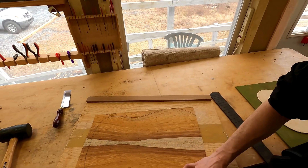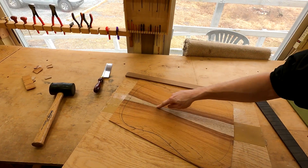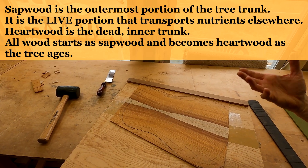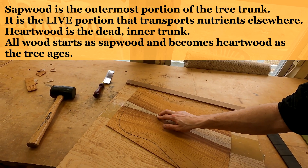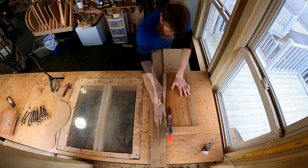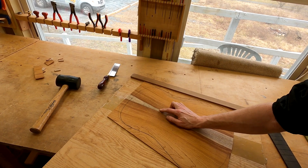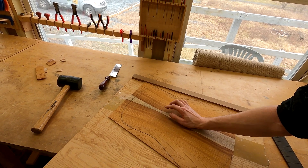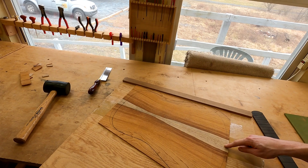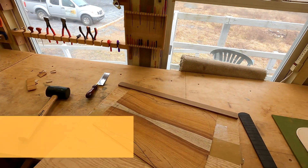This was the one we landed on. One thing that David and I really wanted to do was maintain this sapwood stripe here. When I joined this yesterday, one of the things I was very aware of was not wanting to lose material during the jointing process — where you're planing, sanding the joint, and candle lighting it to get a super tight joint. I really didn't want this narrow bridge of pale sapwood to close up and disappear, because you would really lose the effect. Instead of having a long center stripe, you'd have these little fingers that disappear, and I think it would have killed the effect.